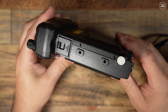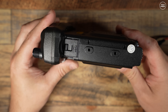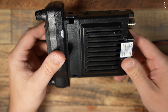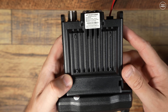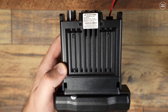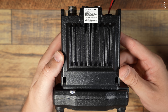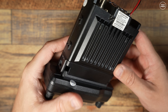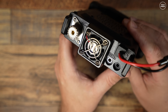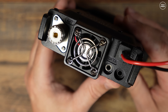This radio is super small — well, the body is — and it has a detachable head unit. It's rated up to 25 watts and covers the 2 meter and the 70 centimeter bands. When trying to select the 1.25 meter band, it was not possible using the direct dial entry, but the specifications do have that frequency bracketed, which makes me think there could possibly be another model.